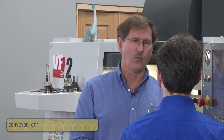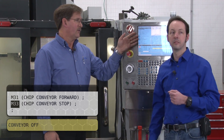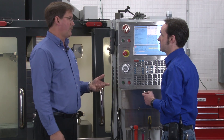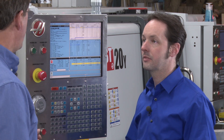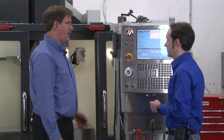You should run the chip auger because it will run in a program. M31 turns it on, M33 shuts it off. So you can put that in the program to have it run every now and then while it's running parts. Is there any reason not to have it run continuously? Just noisy — that's it. You turn it on and off through the program to help keep things clean, because if you run all day without turning it on, now you've got a mess.